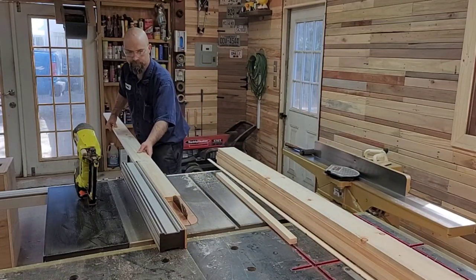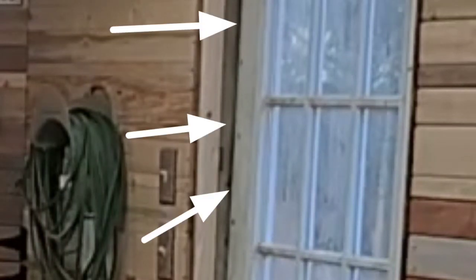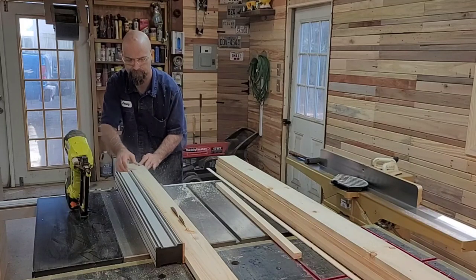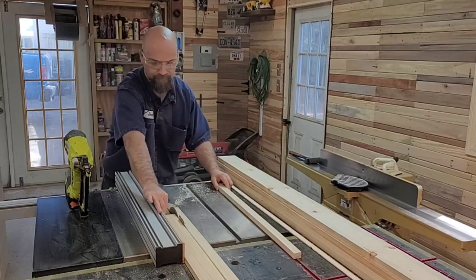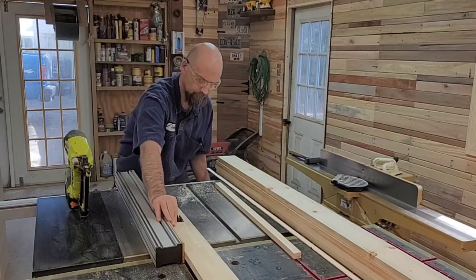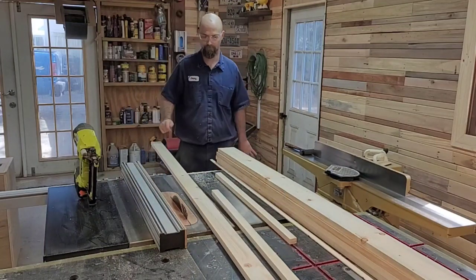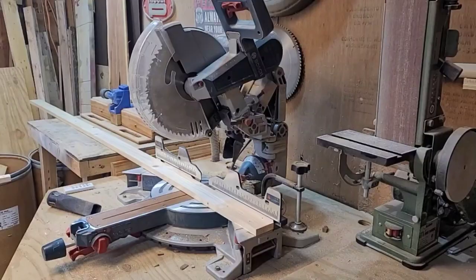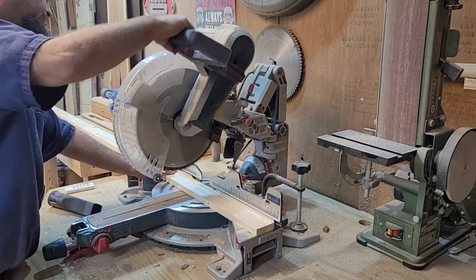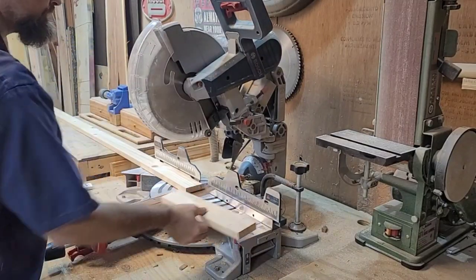I've got my 1/2 inch fillers in there now. Now I have to cut the fillers that will be seen. These are going to cover up this gray area and will act as the doorstop when the door closes. I don't know if you're supposed to layer boards when doing a door frame or door trim, but in my case, I have to layer them. That way I can get a nice clean look when the door is closed and when I finally get all my boards up. Now I can go ahead and cut the right side to length. This piece will be one solid piece and it'll go from top to bottom.